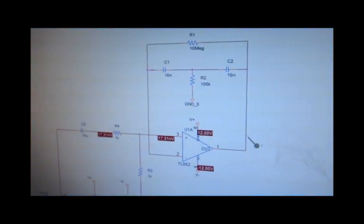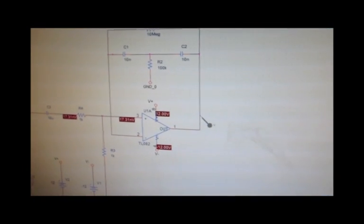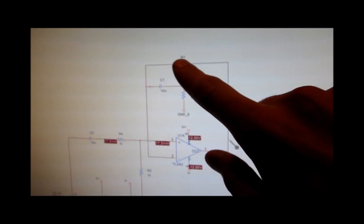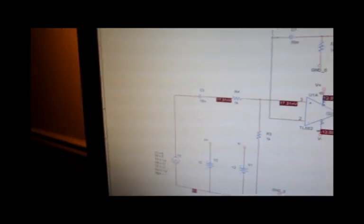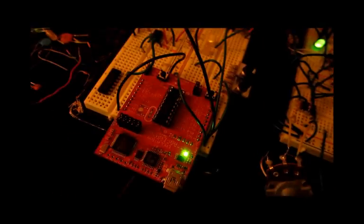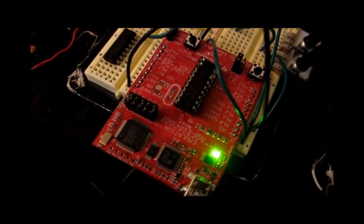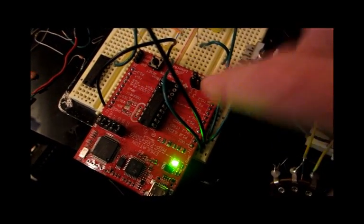Tonight I made a little drum machine based around the Twin T oscillator, which you feed a quick pulse and it spits out a decaying sine wave. It's a pretty simple and fun circuit to build, and you can mess with the decay and the pitch by messing with these resistors. For the sequencer I've got a MSP430 microcontroller, aka TI Launchpad. It's got two different preset patterns and you can select different presets by clicking on the button, and there's tempo controlled by voltage.